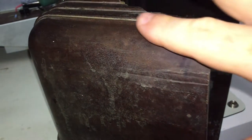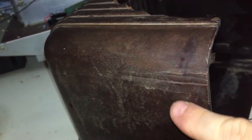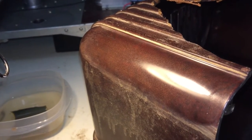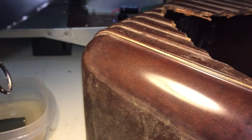A quick test of the surface was done with a very high grit sandpaper — I did it on the inside first, making sure the bakelite wouldn't be damaged with that particular grit. I was able to pull a lot of the defect out of the grain. Obviously the sandpaper leaves it somewhat white-looking, but this could be polished out with some diamond paste. After polishing out the small section, you can see that within the shell of this radio the bakelite can be fully restored using the right techniques. You can see the shine has been restored to this corner here — this is what the bakelite originally looked like.